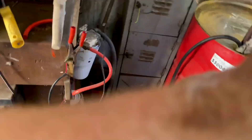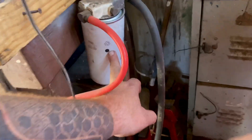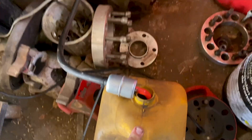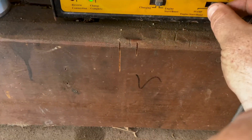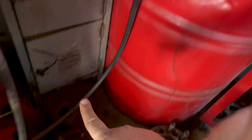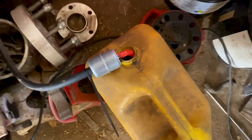After a few hours of sitting, it's time to filter it. You can set up yours however you want, but this is what I had laying around — cheap and mostly free; I only had to buy the filter. This is a 20-micron filter that goes directly into a 5-micron filter before the jerry can. I turn on the pump, and you can hear it pumping: it goes from the barrel through the 20-micron filter, then through the 5-micron filter, and comes out clean.